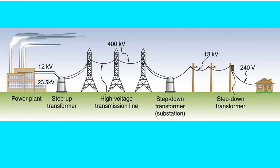We generate electricity at 23,500 volts, which sounds powerful when compared to the voltage in our homes, which is typically 240 volts. But at 23,500 volts, the electricity is not strong enough for the transmission grid, which is a pylon network that covers the UK. The grid transmits electricity at 400,000 volts, which is enough power to transport electricity throughout the country. So how do you increase or decrease the voltage in electricity?